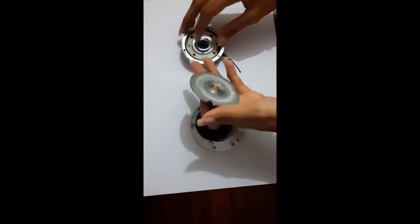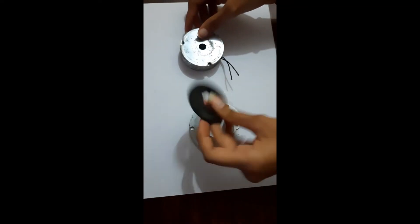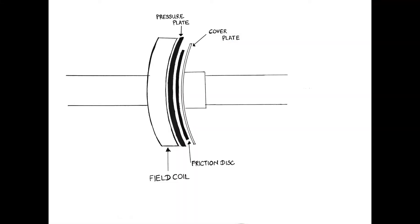When the power is on, the pressure plate presses the spring down so that the friction disk is free to move. The basic principle is that when the vehicle is in motion, it supplies a voltage and current to the coil, making it an electromagnet, which produces magnetic lines of flux that overcome the air gap between the pressure plate and the field coil — pressing the pressure plate against the coil and compressing the springs. By doing so, the friction disk, which is made of some sort of polymer, is released so that the output shaft of the motor in contact with the brake unit is free to rotate.